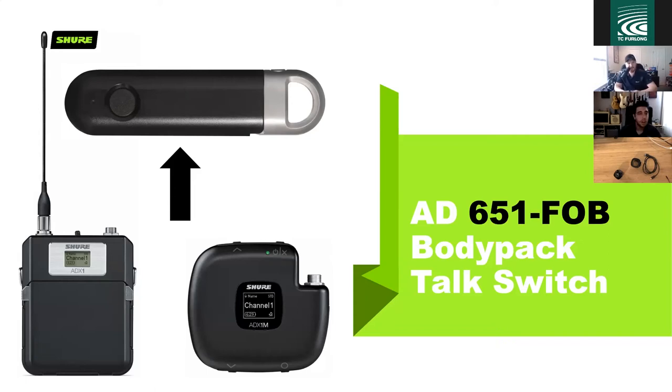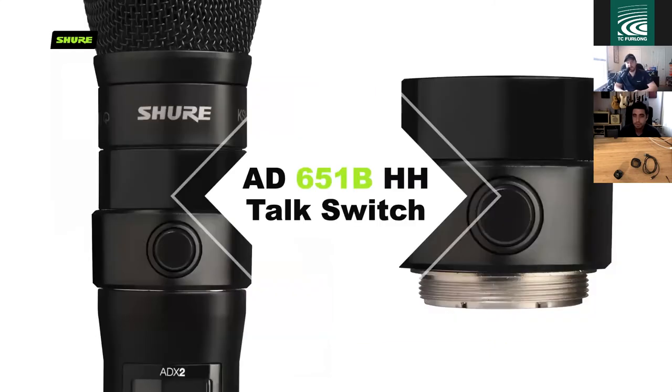Yes, Brian, fire away. Are they a latching switch or a non-latching, or is that something that's selectable by the user? It's a great question. Right now, they're momentary only. So it's depress is the transfer, and then when you release, it's going to come away. So you can manipulate your output source to get the latching that you prefer. If the source is mostly going to air, you'd want to make that your main output and then switch that over. There's some talk about trying to make them momentary or latchable, but right now they're just momentary.